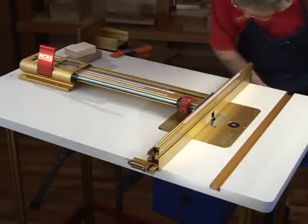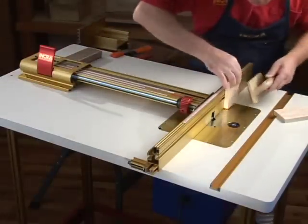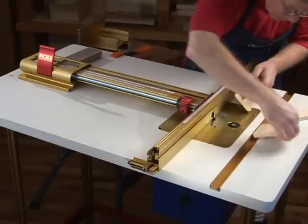We'll start the tail boards beginning with a dovetail-shaped rabbet cut made across each end of both boards. The scoring pass will shear the fibers of the wood to start the rabbet without tear out or splintering, and is a good technique for any rabbet or edge cutting operation.